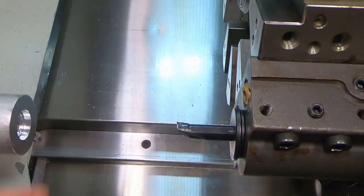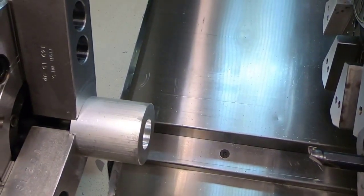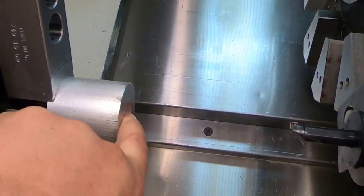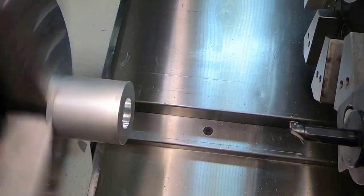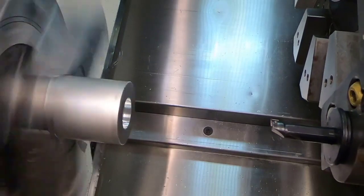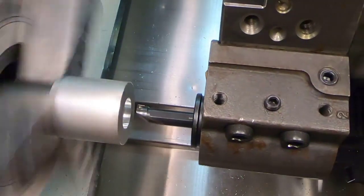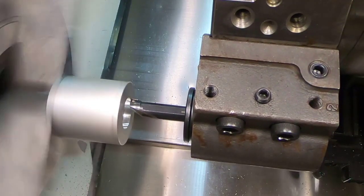So I've got a half-inch boring bar and my hole from our last video ended up at one inch. What I'm going to do is make this one inch fifty-thousandths. Once I do that I know I'm going to be good — that way I can tell the machine where my bar's at. So I'm going to go ahead and turn on my spindle. I'm in handle mode. I still had it at 14% on my spindle speed. Now I'm going to come in and take a real light pass, so I'm going to reduce my increments and come in until I start cutting it.